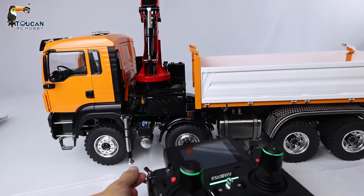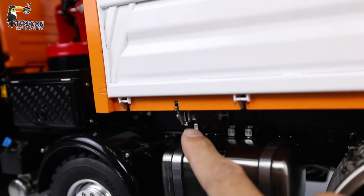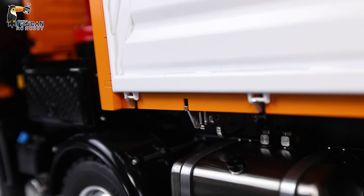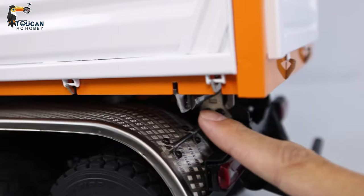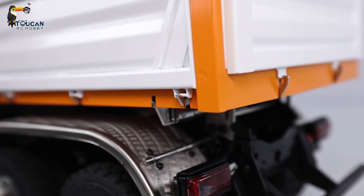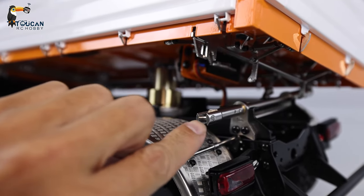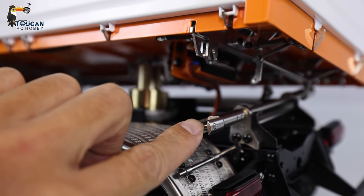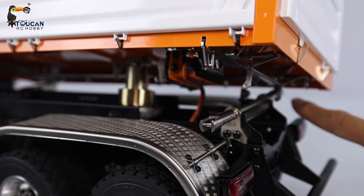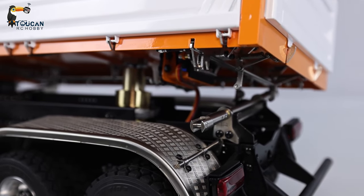So now it's locking rear side. After changing, you will see — only after sitting tight here — now it's totally unlocked. Rear side also unlocked, meaning now only the right side two locks are locked, so you are dumping to the right side. If now you're touching the three-way lock, you unlock the other side and it will drop also. So when rising, never touch the three-way. Keep it back.